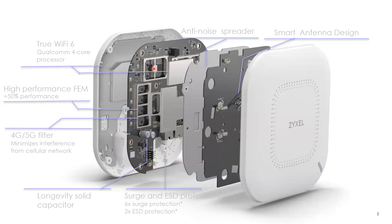We also have extensive shielding on the PCBA — not only to deal with electromagnetic interference, but also to filter out nearby 4G and 5G signals. In a larger office building using a DAS system to rebroadcast 4G or 5G signals, that can cause interference with Wi-Fi APs due to nearby channels. That shielding helps protect from that. We also have a noise spreader mounted above the PCBA, and our antennas are on their own separate board above that — unlike much of our competition, which mounts antennas directly on the same PCBA as the chips.